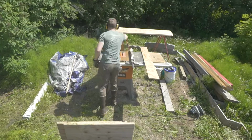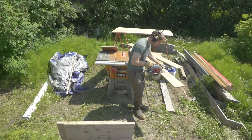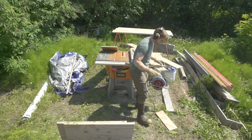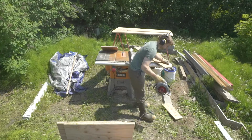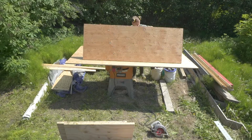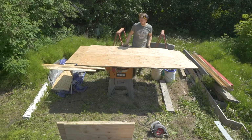The bearings I was able to get are 6 inches square, so I'm going to go ahead and rip the sides at 6.5 inches. I'm going to cut my long side pieces at 75 inches to match the bottom, and then the shorter sides will be cut to 55 and 7/16 to cover the extra plywood on the sides.